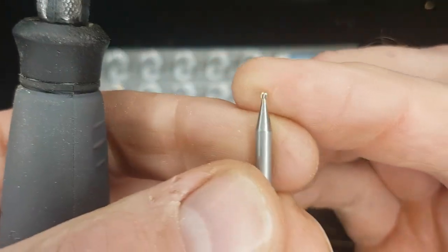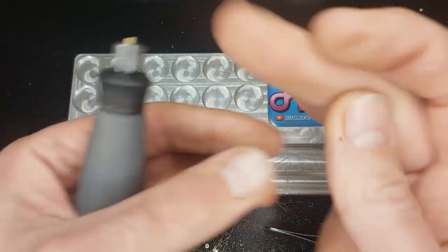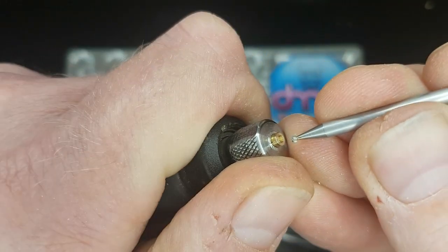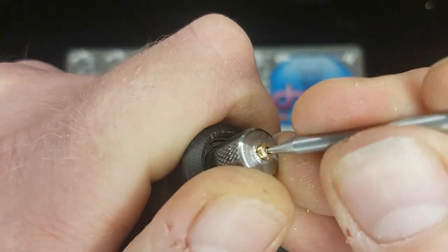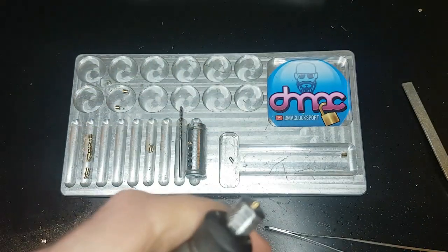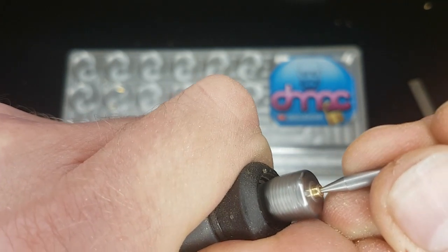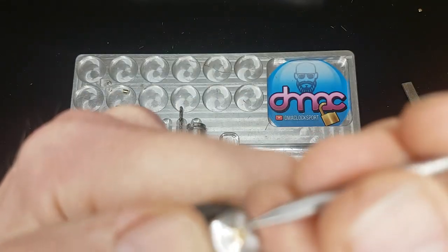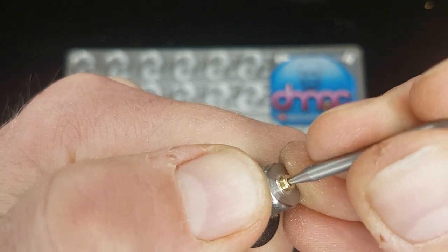To make that channel I'm going to use this engraving bit, which usually comes with a Dremel set. I use it for a couple of things — you can use it to make counter-milling in the plug chambers, but more commonly I use it to engrave my challenge locks with the name on them. I figured if we use this I can just put it inside there and force it outwards, and that's going to create a channel on the inside of that recess to receive the ball of the ball joint. We don't want to go too much because the walls are about half a millimetre. There's a little channel in — I'm going to do a little bit more.